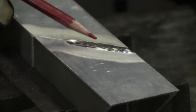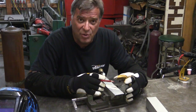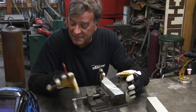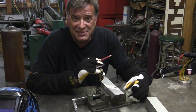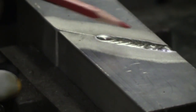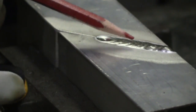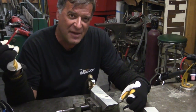The first thing I see looking at this is these little black specs in here. I wire-brushed the aluminum, cleaned it off with a stainless brush, the tungsten was freshly ground, and the filler rod was clean — but I still got these little black specs. I'm going to take that tungsten and get rid of it because I think that's the problem. Looking at the weld itself, you can see a little bit of the cleaning effect on either side, but the weld looks pretty flat — it's a little too warm.